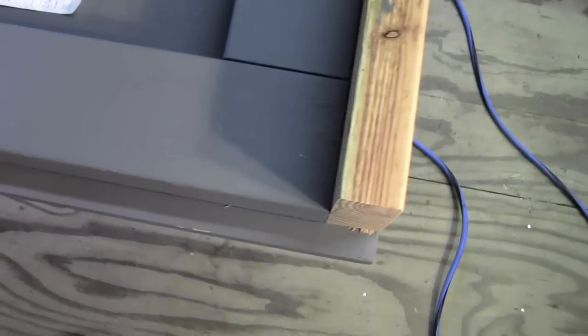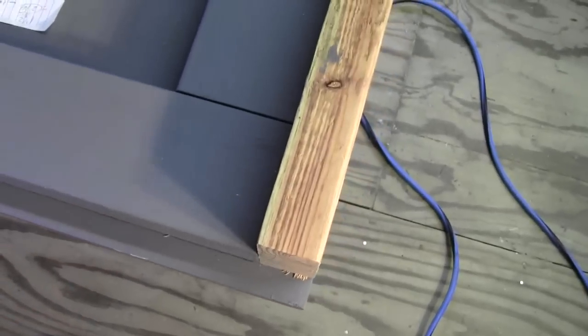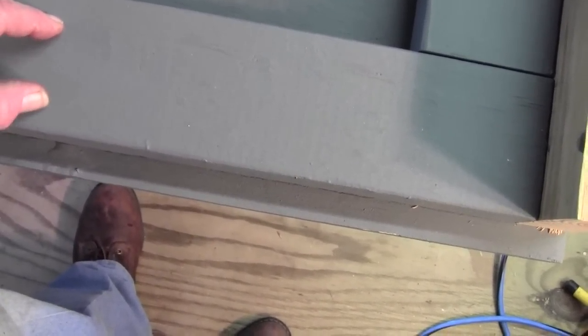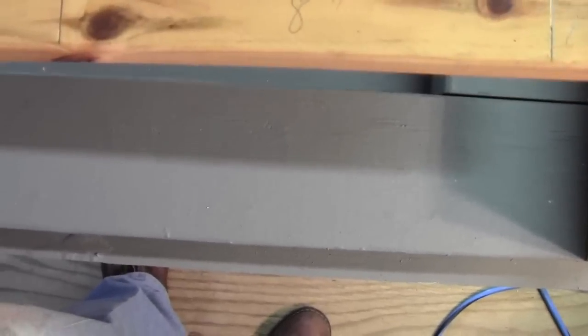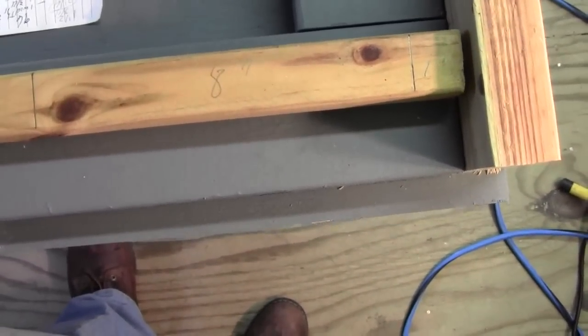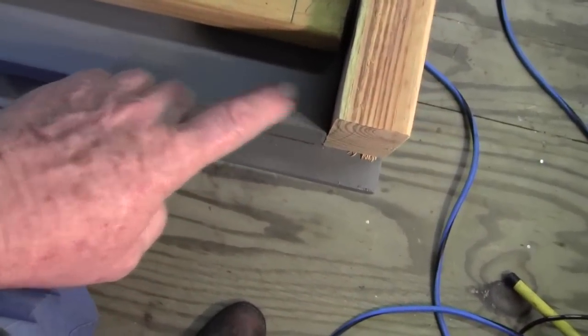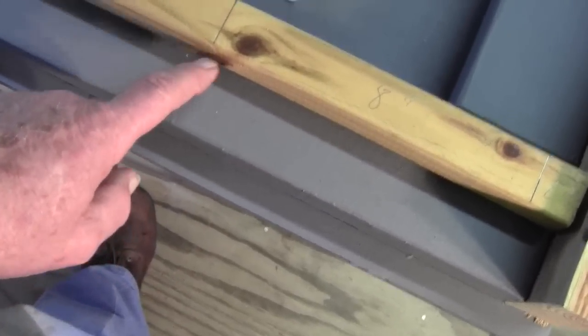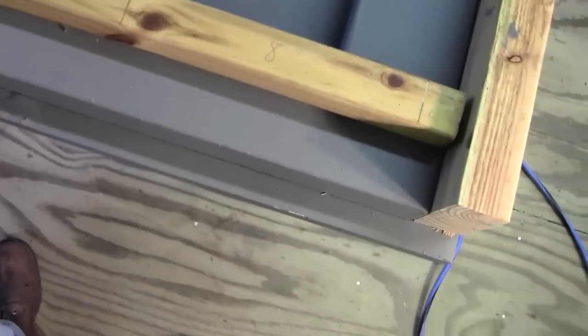I've marked this at three quarters of an inch, and I know I have to stay within three and a half inches, so I'll come in an inch on each side and run a row of screws. Here's my storyboard — you've seen it on other things. It'll go on the end with a mark one inch from the end, and I've marked it every eight inches. This is the rear of the box, marked every eight inches. When I drill that plywood out and clamp the two-by-four where it's supposed to be, I can run a bunch of wood screws in and it'll be solid.